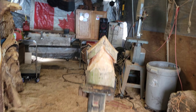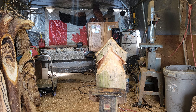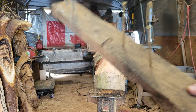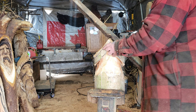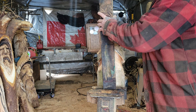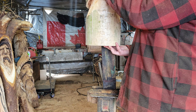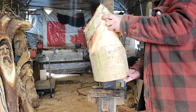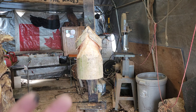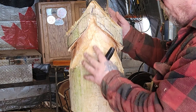So the roof is in. Let's take a closer look. Don't worry about those shingles coming around the front — I'll cut that after. Now you might think, how am I going to carve the face when it's in the jaw horse? Well, I'll show you a simple solution: you just get a board like this with some screws in the back. Take this out, put your board in, put your jaw horse up, and now I can screw this to there and carve right there. You've got to watch where you put your screws because if you're carving here and you hit a screw, it's going to dull your chainsaw real quick.